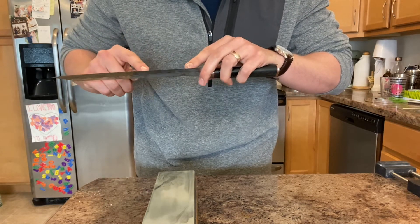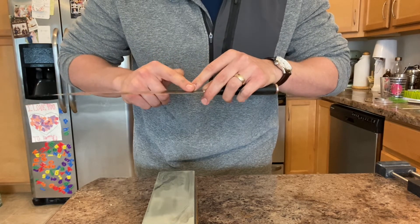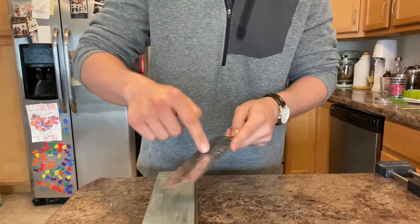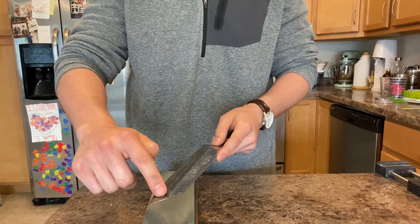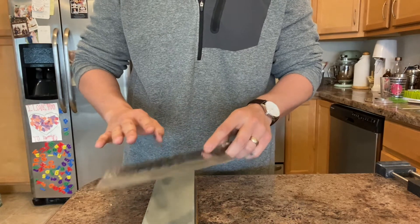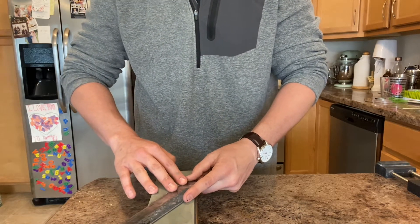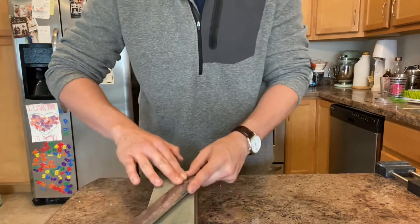Checking this edge — as I was saying, this knife was all sorts of screwed up from the factory. This side is a lot thinner-looking than that side because I fixed one side completely once, but I didn't fully fix the other side. I put about three hours into fixing it and I've spent some time thinning this side out, but I haven't come back to completely finish it. I've got to work on the heel a tiny bit on this side.